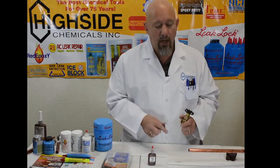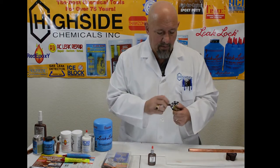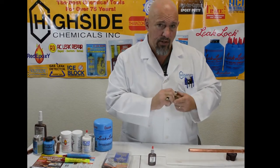A very important note for those of you used to soldering: you do not clean the dust off — you leave it on there, and that actually helps the bonding process. We're going to go to the female side of the brass fitting and make grooves in the same direction. Again, you're going to leave the dust on there — don't clean it off.